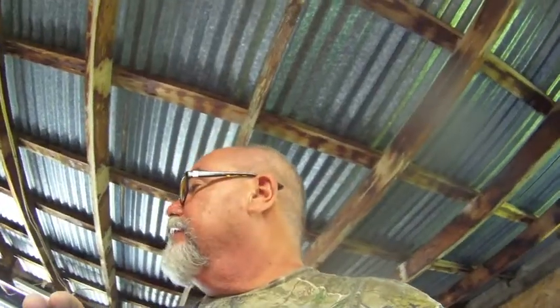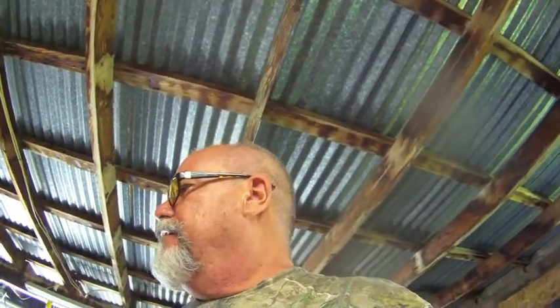And you can use a press in a shop if you wanted to, but the first time I did it, I used a floor jack and got underneath the motorhome and pressed these pieces together. But I didn't like the way that it turned out. It was kind of mangled, and I started thinking this morning, I wonder if the vise would work. Well, the vise opens up far enough, and I've got these 2 pieces of old ply. You can see the circles on them where I made that one earlier today, and just stack it up like this. Put one there, one there, put the cans in the middle, crank it, and you might have to loosen it up and turn the can a little bit to get it nice and even, but it worked, and it worked better than sticking it in the motorhome, that's for darn sure.